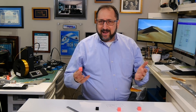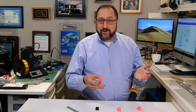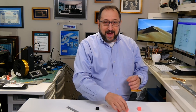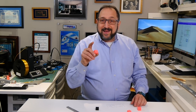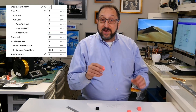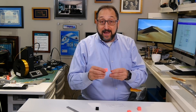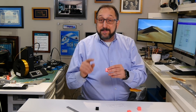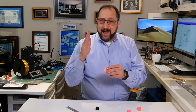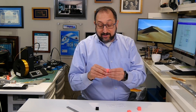However, the printer just feels really solid — it's an upgrade I would do. It's very easy and relatively inexpensive to do. When I reduced maximum jerk to 8 mm per second — it was set at 20 in my profile originally — the combination of all of these things did produce a really nice print. It completely eliminated ghosting on the x-axis, so I'm still printing at 60 mm per second. I've reduced jerk down to 8 mm per second, I have the anti-vibration pads, and I have the rods. The combination of all these together produced a print that on the x-axis is absolutely perfect.